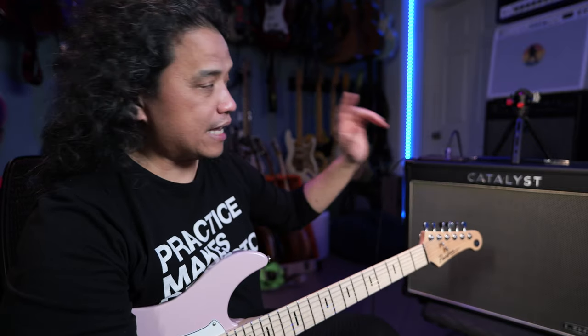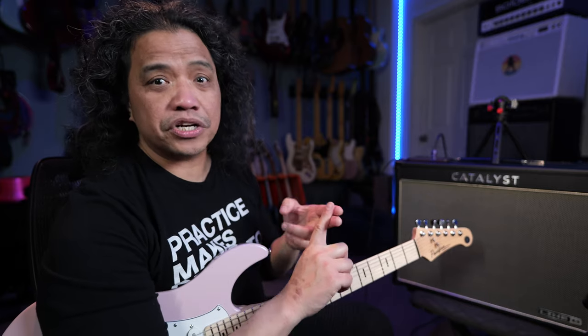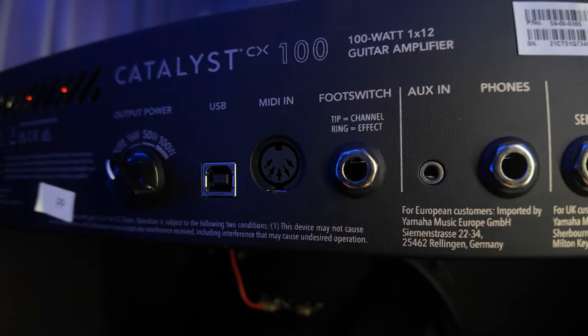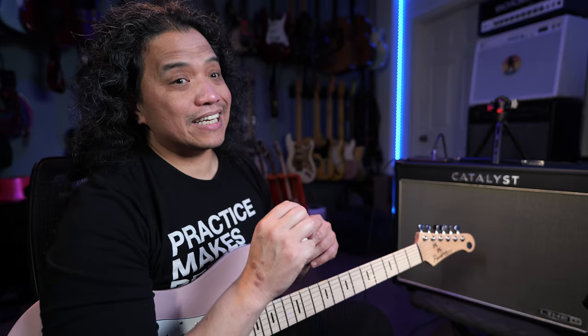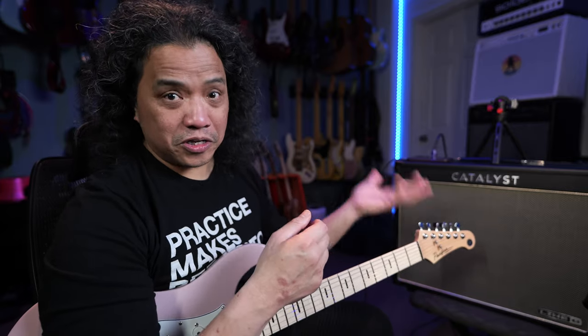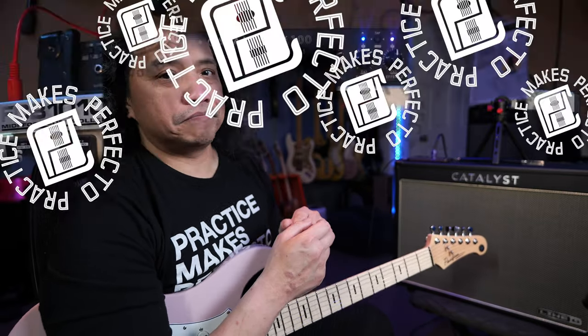It's still a pain to program, but it does the job in opening up all the capabilities of the Catalyst CX100. Like with the old Catalyst, there are still three versions: the CX-60, the CX-100, and the CX-200. The CX-100 and CX-200 have the 5-pin MIDI ports. While the CX-60 can still be controlled by external MIDI, you have to go in MIDI through USB since it doesn't have the 5-pin MIDI port.